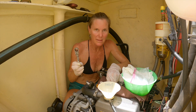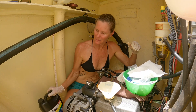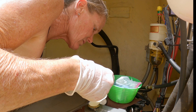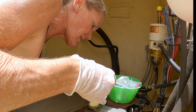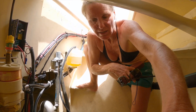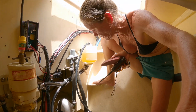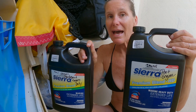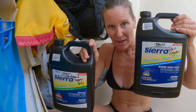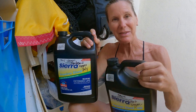Now all we have left is filling with clean coolant — this is almost the hardest part because I don't want to make a mess. Pouring it nice and slow to avoid as many air bubbles as possible. We got almost one gallon in, including the overflow tank. The coolant we're using is the yellow stuff — that's all we could find out here. Both coolants have the same properties, so it's okay to use this heavy duty yellow one instead of the red-orange one. This is why one jug is starboard engine only and the other is port only.